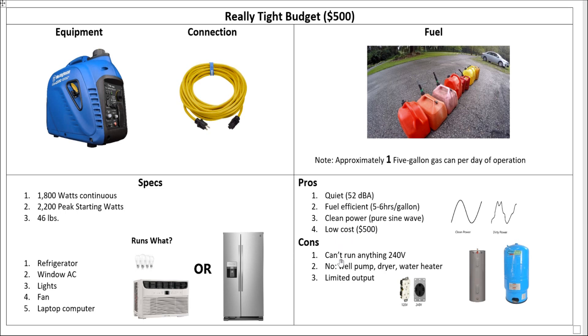It's low cost — just $500. The cons: it's a 120-volt system, so you can run anything on a standard 120V plug, but you can't run anything 240V. That means no wells, no water heaters, dryers, big air conditioners — anything that's 240V you can't run. That's a really big deal if you live out in the country and you're on a well, because having water is more important than having power. If you're on city water, it won't make any difference. For $500, this will solve the majority of problems you're ever going to see — any kind of temporary power outage, even a week-long storm. You can still have one cool room to sleep in and your food won't go bad as long as you're rotating it and staying on top of it.